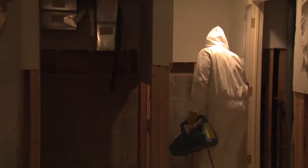We're going to put the floor back on as soon as we can, and then what's under stays under and doesn't come in. And we're going to literally spray every exposed lumber that's in there. And then we turn up the machine to a fine mist, and we basically mist the whole house. Because what we want is we want this chemical to land on something. Whatever it lands on, if there's an organic substance, it will kill it. So the sheetrock, the lumber, the flooring, we just want to basically engulf the house in a mist.